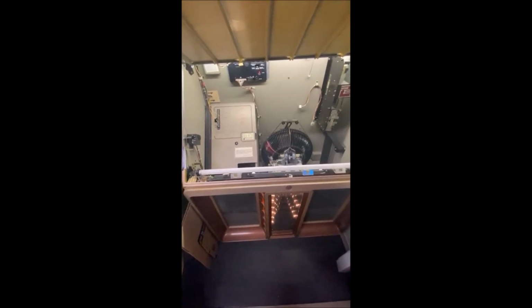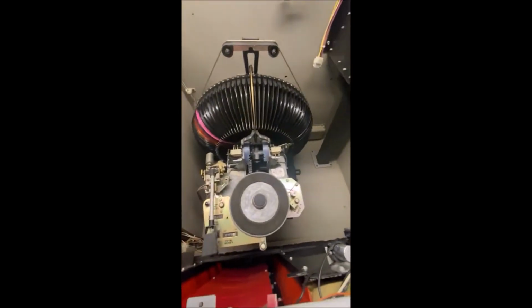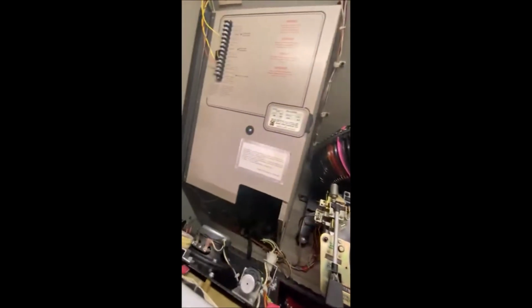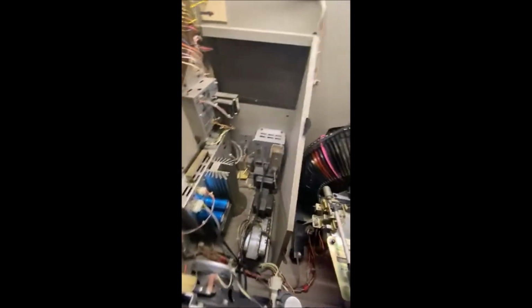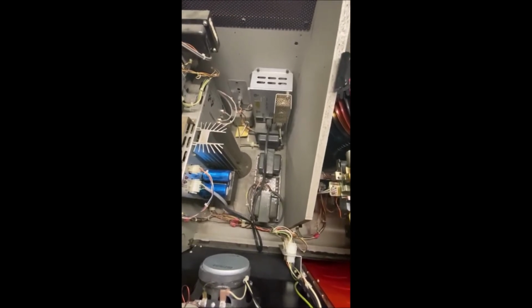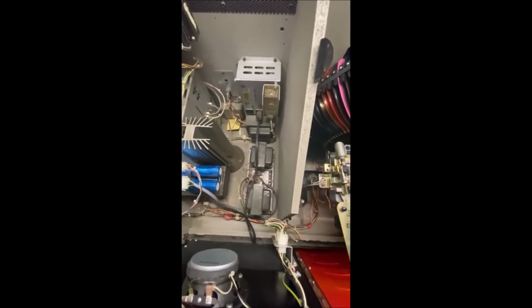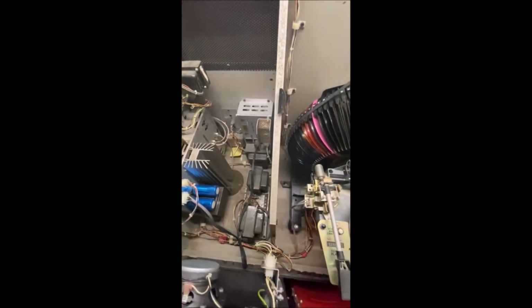Okay, back with the Rowe amplifier testing. So here's the inside, in case anyone's interested. You get your mechanism. I have the light works here, but I've got it off right now. Your amplifier goes down here, and you can see the power supply and the speaker transformers where you can tap off for different volumes, or if you want to run externals. You also have 70 volt hookups down there if you're running into 70 volt speakers up in the ceilings like they used to do back in the day, like we had in a bunch of cafes and stuff.